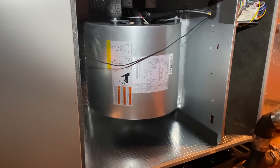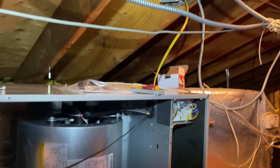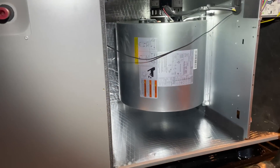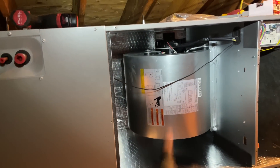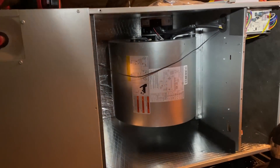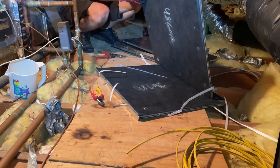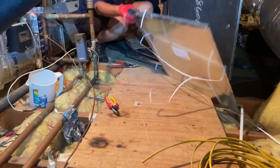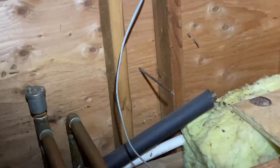It's around 9:15 in the morning. Slowly getting things done here. We have the air handler installed, all in place, powered up, fan running. Joey's working on the return plenum — it came knocked down, so we're going to put that together. Mike's got some screws, we're going to secure the supply plenum. Then I've got to replace that flex, drill a hole for my line set, and hopefully we're out of here by 12.